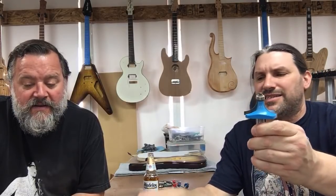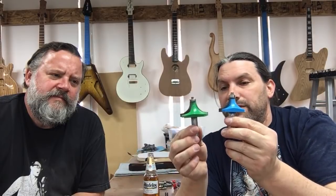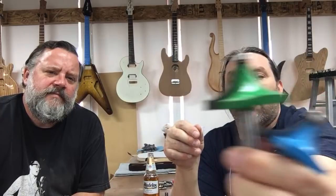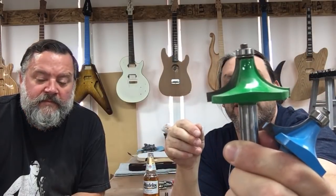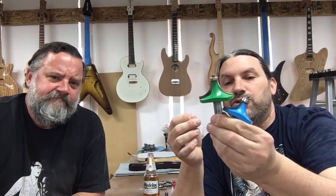Let's talk about some other roundover bits. We've got a 3/4-inch round and I think a 7/8ths roundover. These are great for beginning the profile on Fender-style necks. You put these in the router table and buzz — imagine taking all of that off the sides of a neck. It becomes very easy to continue shaping by hand or on the drum sander. These are great tools for that.